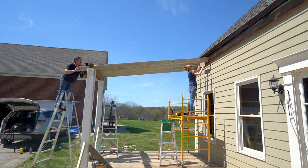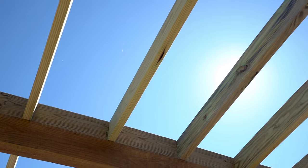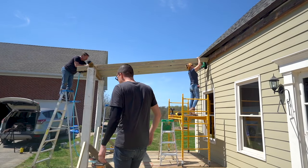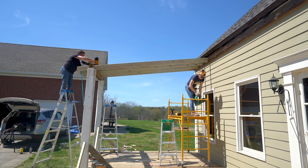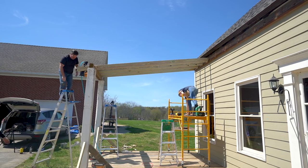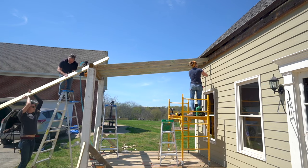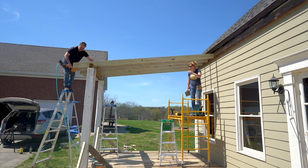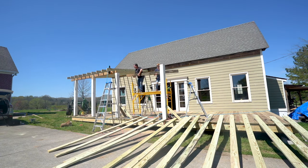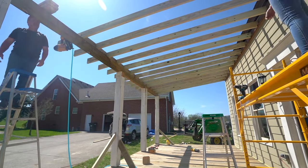Greg had his own spacer system at his end: the front of the porch gets blocking between each rafter — a board cut to length and secured in place. This gives rigidity to the rafters to prevent them from rolling and also closes off the gap between the top of the header and the top of the rafter to keep birds out. Our videographer Justin also helped by passing rafters up to Greg, saving him trips up and down the ladder. With a third hand, we could attach two rafters before shifting the entire operation. After installing all the rafters on two posts, we'd both hop down, install the next post, the next header, and repeat.